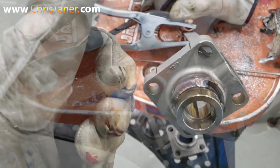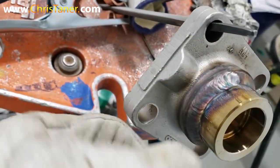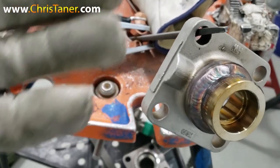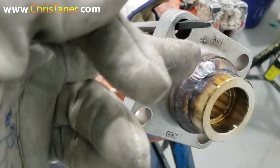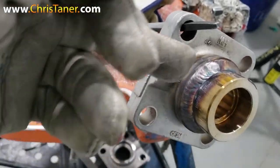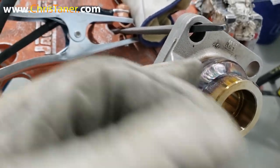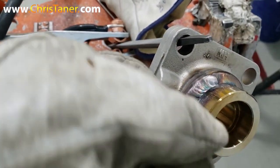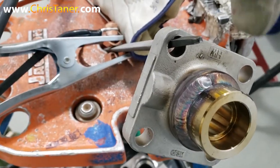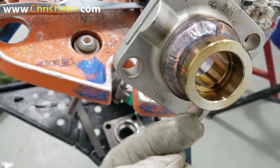Thumbs up. And remember, whenever doing this, it's not a race. You're not racing. You're practicing your technique, on how you can stay steady. And on this corner right here, I call it dead man's corner. So again, you're practicing on how you can stay steady and not slip whenever you get to the side of these corners. You want to be able to walk the cup all the way around, all the way till you get to 12 o'clock. You want to be able to walk it from 6 to 12 without slipping.